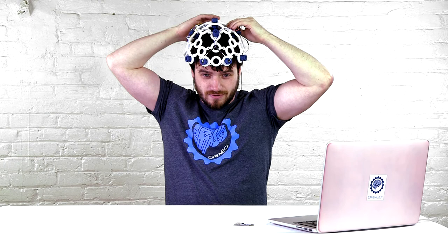Now I'm going to show you how to use the Ultracortex Mark IV 8-channel with the Cyton board. Now we're going to take the headset and get it in the right place on our head. Go ahead and put it on. First thing you want to do is make sure the center node is lined up with your nose, and then you want to adjust each node, including the comfort nodes, until you feel them touching your scalp. And then you want to connect your ear clips to the earlobes.